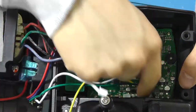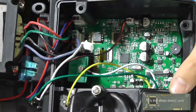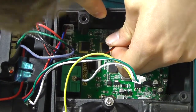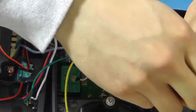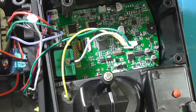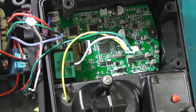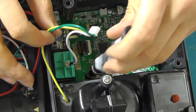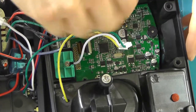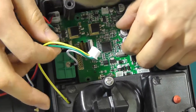I'm going to remove this connector. I think this is an earthing wire, which is rather nice. So remove this, and this is for the fan — I can also remove that. So let's take this PCB out of here and try to identify what the problem is. He said that it's probably caused by a bad temperature measurement system. It was on at max load for too long, and that caused the PCB traces to heat up enough to just burn away, apparently. So the PCB traces acted like a fuse, which is rather surprising.